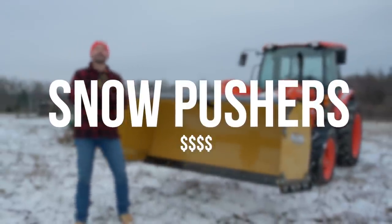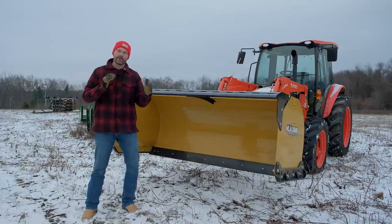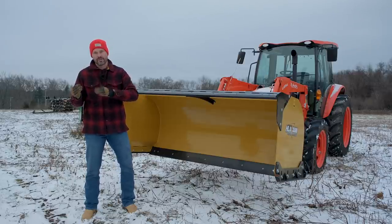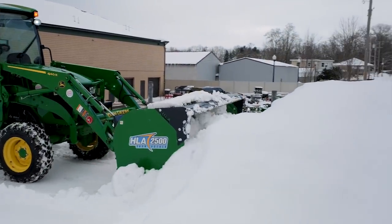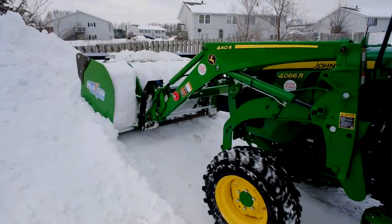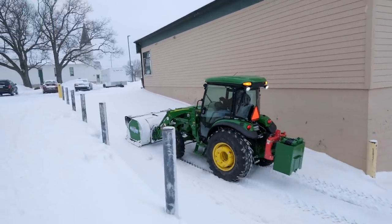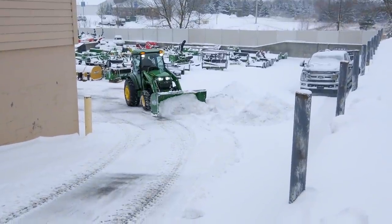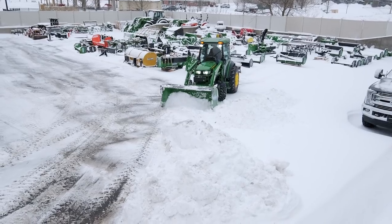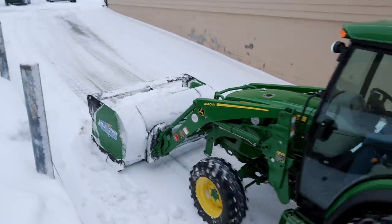It's time to talk about snow pushers, which are my favorite - I don't make any bones about it. Keep in mind we're going from cheapest to most expensive, and this can vary depending on manufacturer, equipment size, and options. A few reasons why the snow pusher is my favorite: it mounts to the front end loader, giving you great visibility right out in front. There are no additional hydraulic hookups required to angle anything - it's just a box with a quick-attach skid steer or John Deere quick attach and away you go. Why I like it over a plow is that the back wall sits a lot tighter to the tractor, giving you more control to steer and more force behind the load compared to a plow blade sitting out another foot or 18 inches.